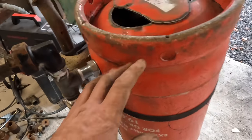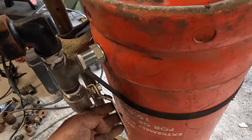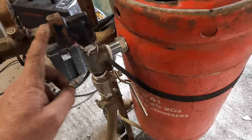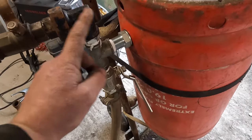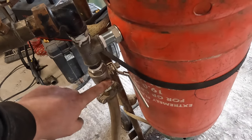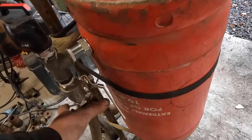Or if you've got a bit of damp media and it's been stood in the pot for a long time and it's not flowing properly, you can just crank it a little bit until you find out what works for you, but you still want your flow to go that way. That's just so that if you crank it, it restricts this to put more air into that to push it through.